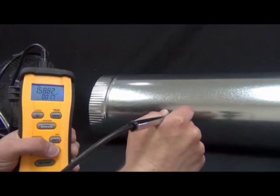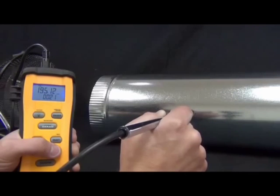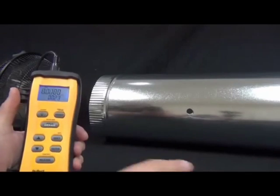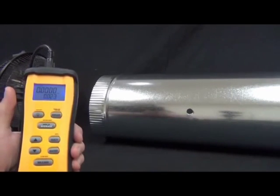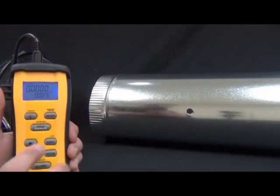Pressing up lets me see my average feet per minute — 450 — and up again to see my average temperature, then back to average CFM. That way we know we have an accurate CFM across the entire duct, not just on one side or in one spot.